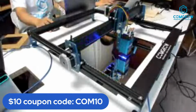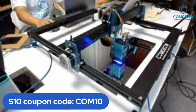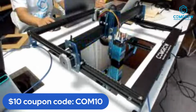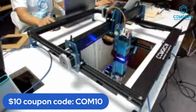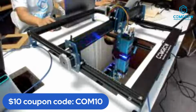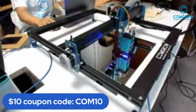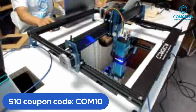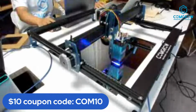And why we show here today this mirror steel: this ordinary 5 watt laser does not have the compressed spot built inside, so it's more or less the same as a 1.6 or 1.5 watt laser. Because they do not have the compressed spot built in, they cannot engrave on brushed stainless steel or mirror stainless steel. What we are going to do is use this 400 by 400 work area to engrave a huge piece of mirror stainless steel. It should be a Spider-Man once it comes out. The working area we are using now for this Spider-Man is 300 by 300, which is already super big. That's why it takes about 20 hours, more or less.